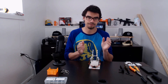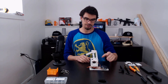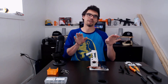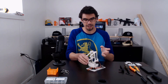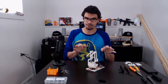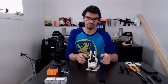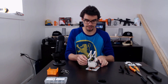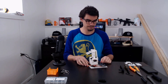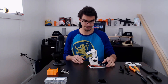Generally you would not want two servo motors doing the same operation. An ideal design for this would be to have a higher torque servo right in the middle operating the whole arm, just to make sure that it's all in sync. It's hard to get these two motors to do exactly the same thing at exactly the same time and not fight each other. But anyway, let's code this up and wire it up and get the motors moving.